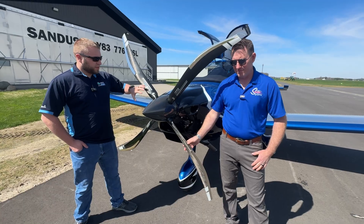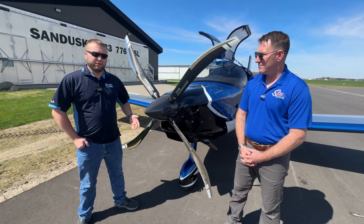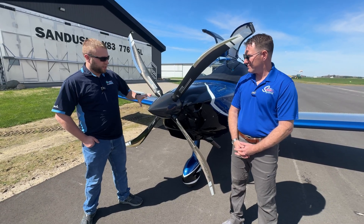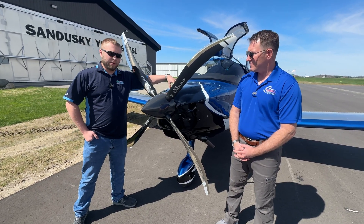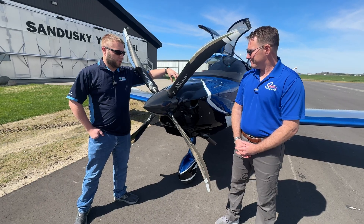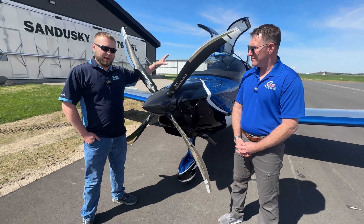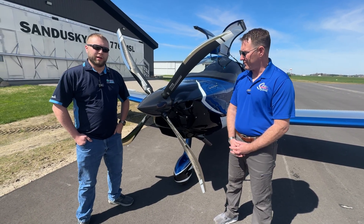Let's jump into it. This is the Duke Tiger four-bladed prop. This one is the 1800 millimeter diameter, which is roughly 70.8 inches. In comparison, the Air Master that came off of this was a 72 inch diameter. The propeller is hydraulically operated, and so there is a governor that sits on top of the engine on the gear case back here. Our governor being the electronic control one means that there is an electronic servo that runs it, which is basically a replacement for the blue lever. That electronic servo on the governor is being controlled by the Flybox APR1 that we have mounted to our instrument panel, and we'll talk more about that later. We'll get up in the air and show you how that works.